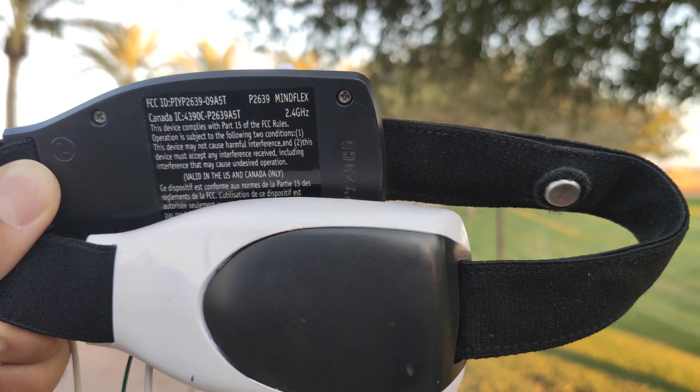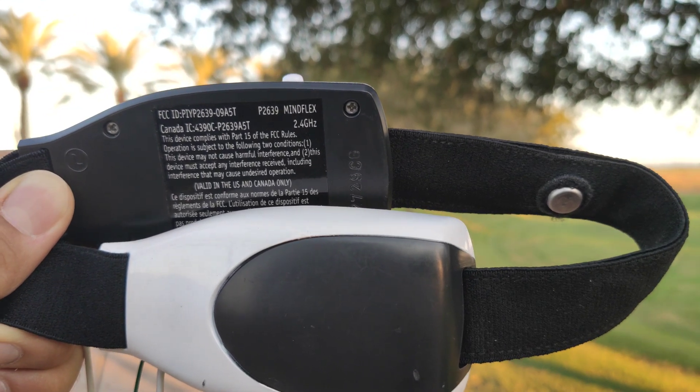The first generation of this project utilized the TG-AM1 chip by Neurosky. I chose this chip because it is able to output raw unprocessed EEG brainwaves. This chip also incorporates its own processing which outputs brainwaves alongside Neurosky's very own patented attention and meditation values.